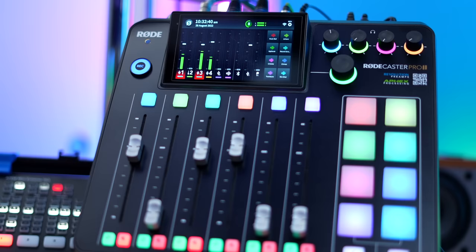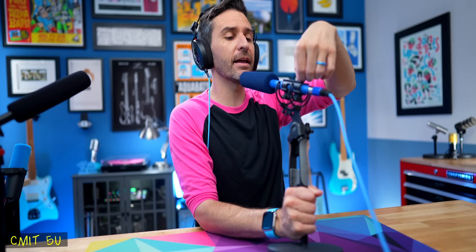Let's start with the steep low-end roll-off. This is without it — just my normal voice. And now with it engaged, there is significantly less low-end in my voice. If there were wind or something, this would help eliminate that sound. Now with the more gentle low-end roll-off: this sounds pretty neutral, significantly more gentle than the steep one. And now the high-frequency emphasis: this pushes up some of those high frequencies. This almost sounds more like the 416. This microphone is running into the Rodecaster Pro 2 with no effects, no processing — just a generic dry signal.